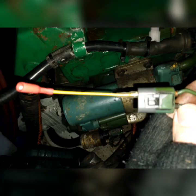These were clipped onto a small connector, and this connector was used to provide the two new wires that we ran through to the gauge part of the water temperature sensor and the gauge part of the oil pressure sensor. In reality, it only took about 30 centimeters of wire for each one. It was all quite close together, and the job was quite neatly accomplished. Though, as I say, we can do this job for you. If you send the whole thing off, then we will add the new wiring into the original Volvo wiring.